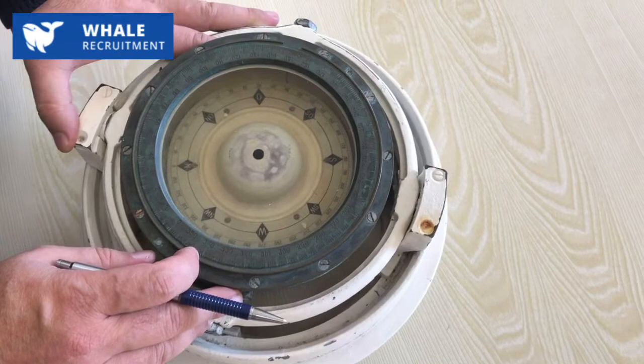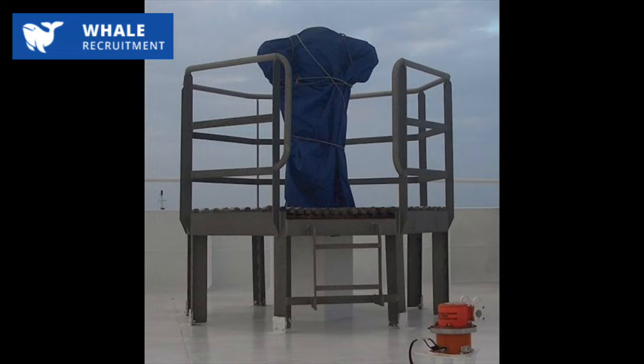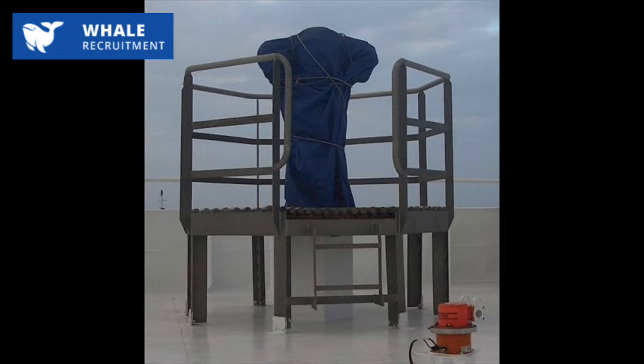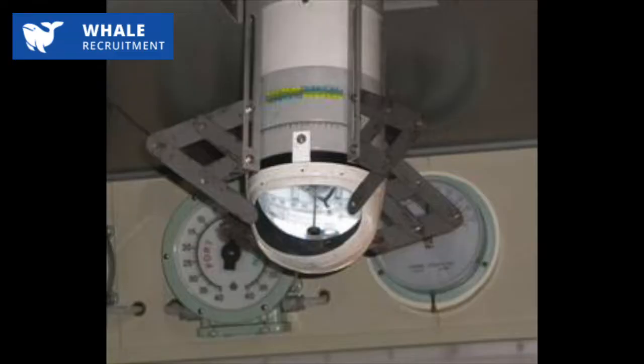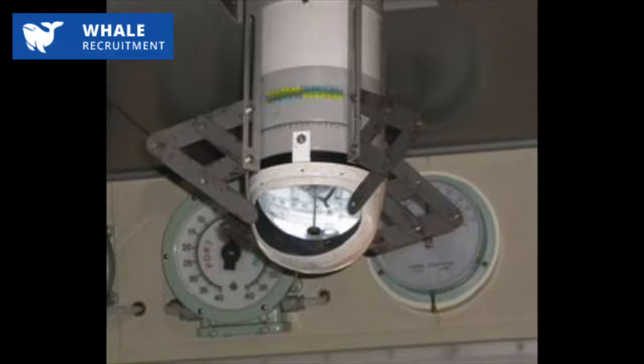In order to reduce deviation, the magnetic compass is located at the upper bridge, where it is fully open to the weather. Remember, it must be covered at all times — open it just for checking. But how do you use it if the magnetic compass is on the upper bridge and you are in the navigational bridge? There is a periscope system from the upper bridge to the navigation room, fitted in front of the helmsman so he can see the course in the mirror.